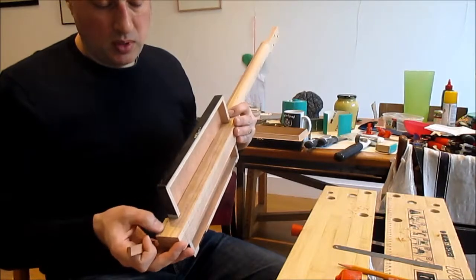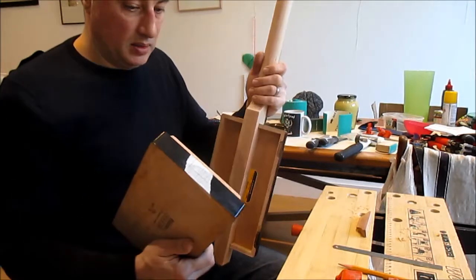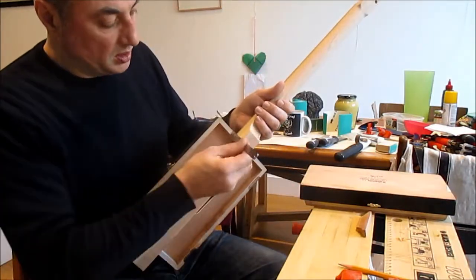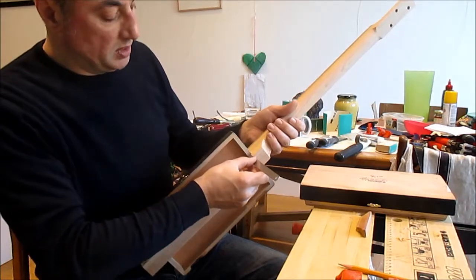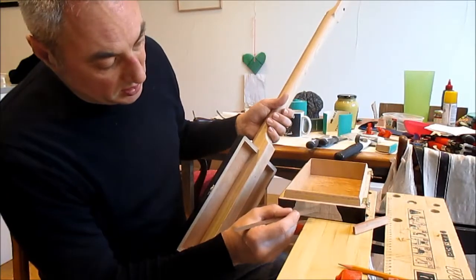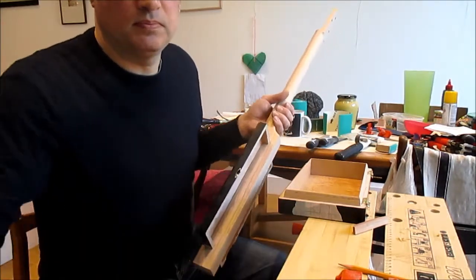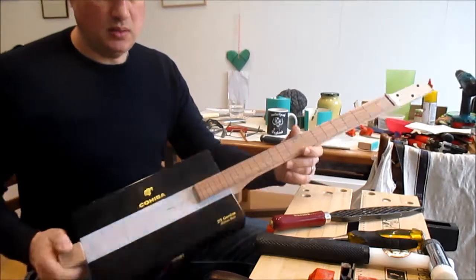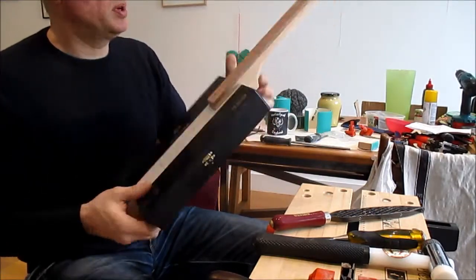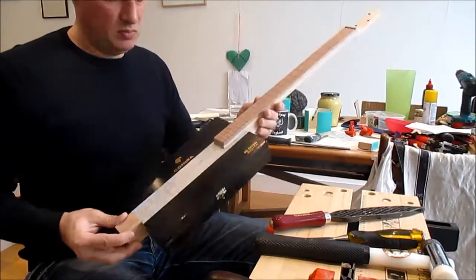So now I've got to cut away the notch at the back there, and also cut away the back here to fit on there. Because I can get my measure here, and I know that I've got 16 mil, these need to go down 16 mil at both sides, and then things should fit in perfectly. So off we go. Okay, that's the bottom done now. Maybe a little tiny bit of tweaking, but basically it's on and it all fits very nicely, nice and solid.